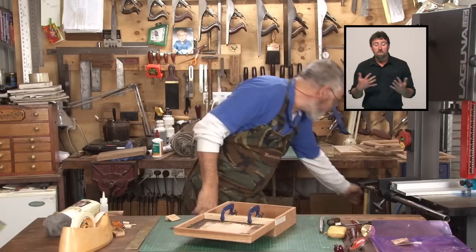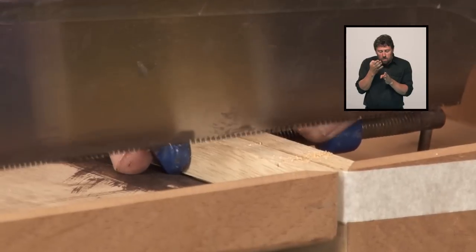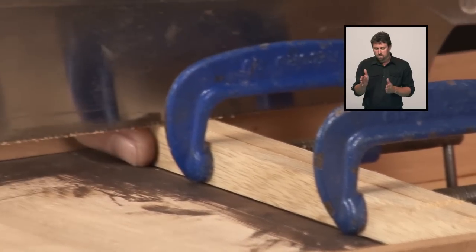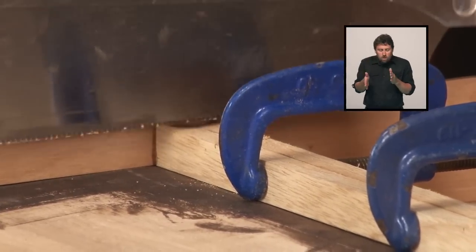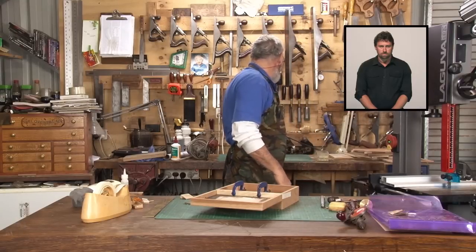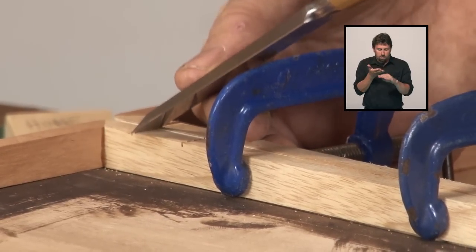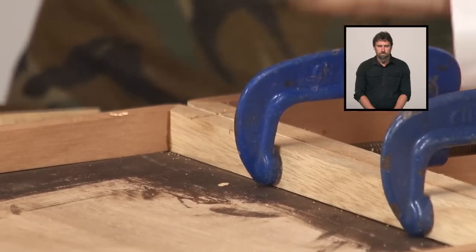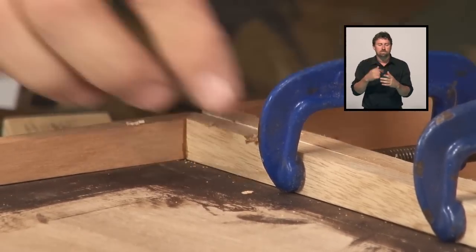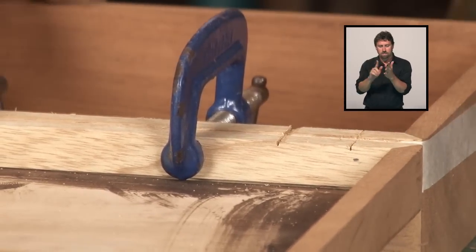Now, if you want to, and you're very gentle, just take that down a little bit with a very fine saw, just on the inside of the cut, but don't go too deep because you don't want it to go deeper than the depth of the hinges. And then grab a sharp chisel, and I just notch out up to that line. So I've got nice registration marks. Okay, I'll finish doing this whilst we go to a break. And then when we come back, if everything's good, we'll be able to screw the hinges in. All right, I'll see you the other side of the break.